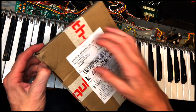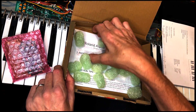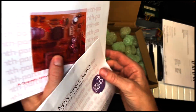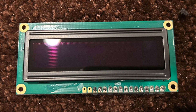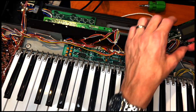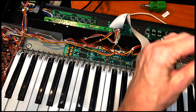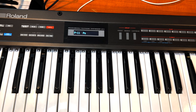This is the part that arrived from synthparts.com — this is the new OLED display. We're going to pull the old display out because the backlight is shot and it's just not as nice looking as an OLED. Let's pull out the old 1x16 LCD display. You can see there's the inverter cable — I just cut the white and black cable and install the new OLED. It's very simple, just plug in the ribbon cable and put in the four screws. Let's turn it on — and there it is. Unfortunately it has a ROM issue where it only displays half the screen.